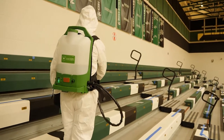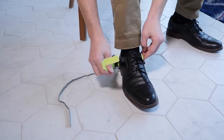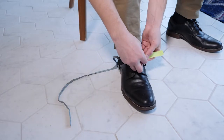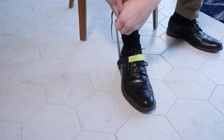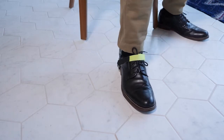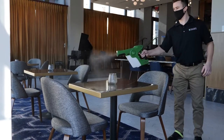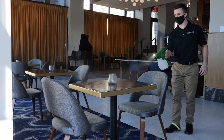If you are still experiencing ESD, utilize an ESD heel grounding strap, ensuring the conductive ribbon is tucked inside the operator's shoe, creating a grounding path for charge to travel from the operator to the ground. Please note, a heel grounding strap is an optional item that is not included with the sprayer.